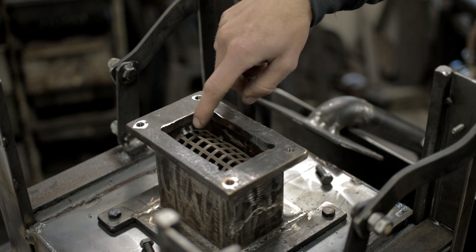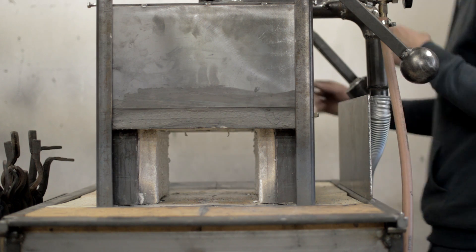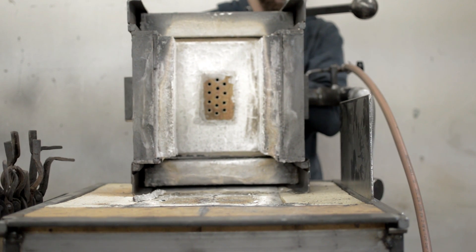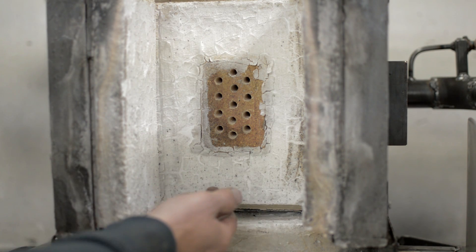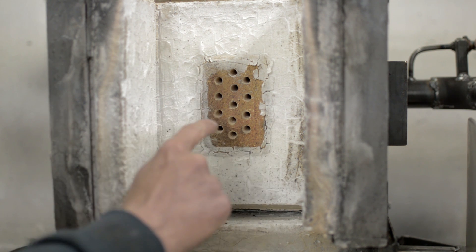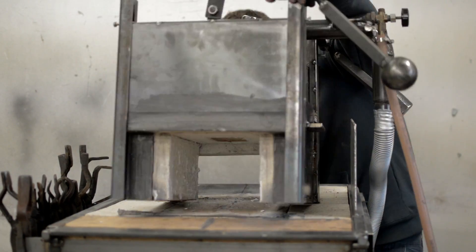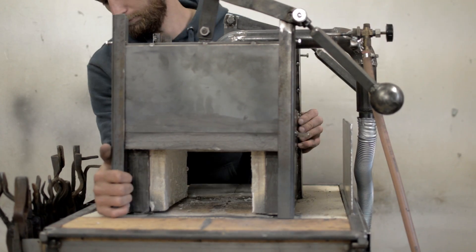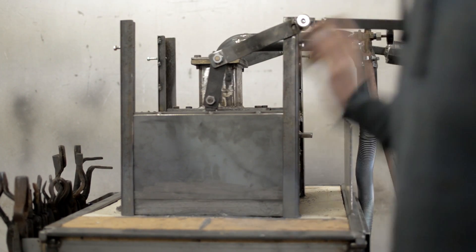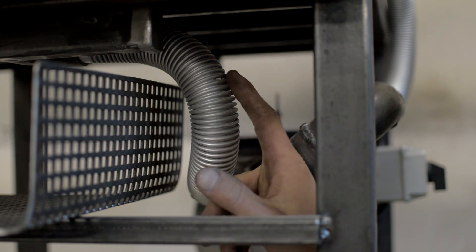I put three layers of perforated steel here so it mixes up the air and the fuel. The air and fuel mixture then goes into the forge through this ribbon burner, which I made just by drilling through a fire brick. The blower is too powerful for this burner, so I decided to route the rest of the air up through a separate hose.